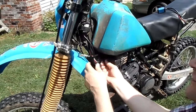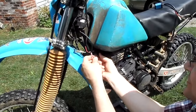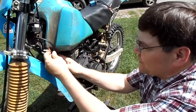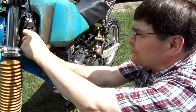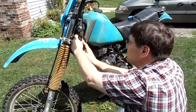What I did, guys, is I bought a vacuum chamber, so now when I pot these things, I first put the potting in a vacuum chamber, get all the bubbles out of it, and then pour it — makes for a better finish, no voids in the pot, better contact with the electronics, better support, all those kind of things. It's a nice product. I'm pleased with the results.